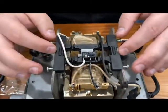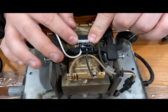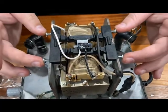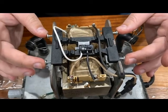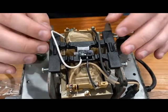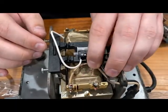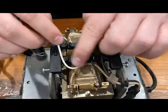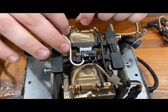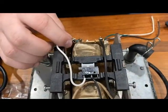This is what it would look like when you put the new one on there. You'll have the slide switch assembly in between those two electromagnets. You'll put all the screws back in there. Then we'll have this wire that's already soldered in from our new unit and we'll solder that connection. Then we'll have this wire that will come over here through this little channel, and we'll solder it over there, and then we'll be good to go.